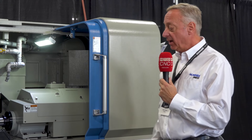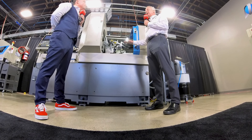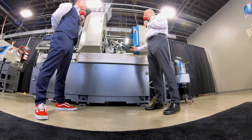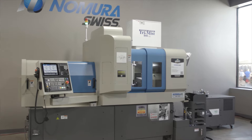How do you guys deal with that? We first off have a full base casting and we keep the oil inside that base. The oil heats up during the machining process, stays in the base, and keeps the base the same temperature — so it's very thermally stable. What that translates to is really holding size on the parts. An alternative would be a separate sheet metal coolant tank where the oil comes through the machine, goes out to a holding tank, and lets the casting cool — giving you a fluctuation in temperature. That means you have to check parts more often and adjust offsets. We can avoid that and run more unmanned as a result.